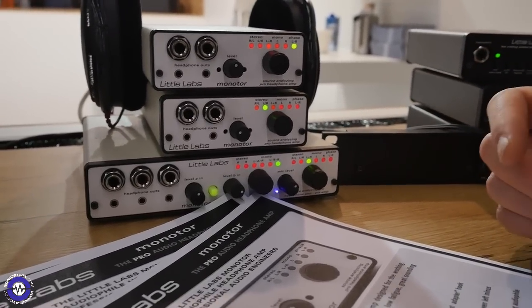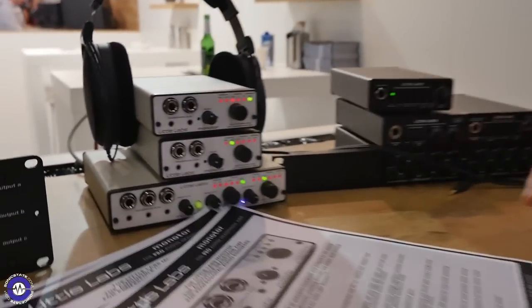Another thing the headphone heads are always concerned about is the output impedance. The output impedance of the driver we use is 0.6 ohms. That's basically 0 ohms. Most other output impedances are usually 10, on a good case, and some as much as 120 ohms, which is actually an AES standard. So it can drive easily with a very nice dampening factor with any phone. Drive anything very capably. That's pretty much it.